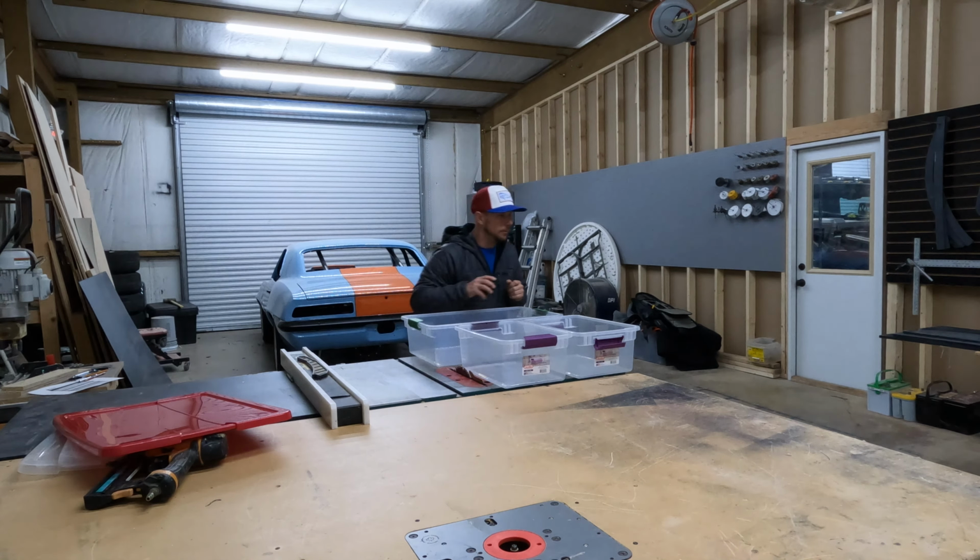So I just told you that 23 1/4 will make this shelf right here comfortable. But we've got enough material. Let's go ahead and use what we've got. So 23 1/4 plus 3/8 is 23 5/8. For good measure, I'm gonna go ahead and make them 23 3/4. And that'll leave us with an inch left over that the blade can take up. So let's set our saw up and let's go ahead and cut those dimensions right now.